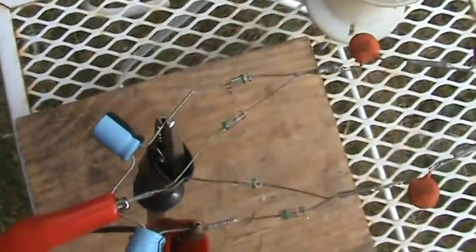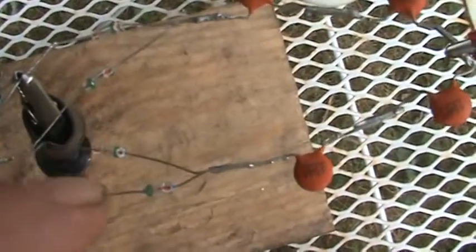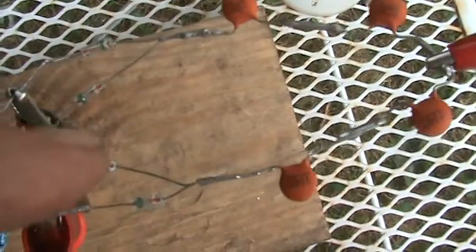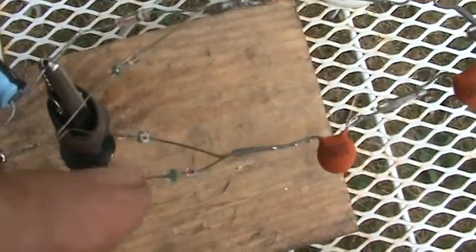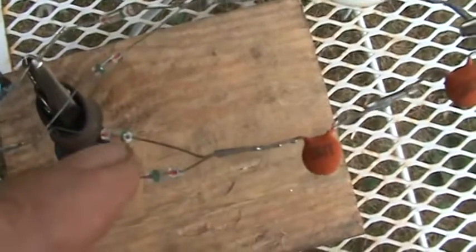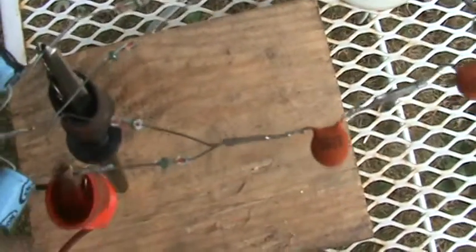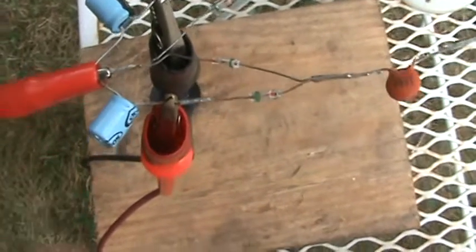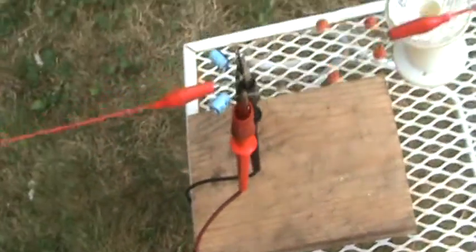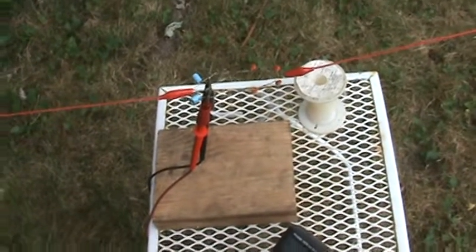Got to be careful in your circuit, too. A lot of people — and even myself many times — have accidentally touched across the circuit in different areas with either your probes or even just your fingers, and you could blow out your diodes. All of a sudden you'll be wondering why you're not getting that much voltage. So you've got to watch that. Discharge it too — touch across where you've got the probes after you disconnect the antenna, so you don't leave a charge in your circuit when you're not using it. Until next video, see you later.